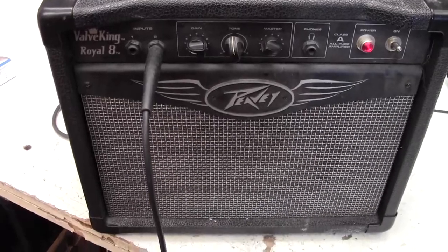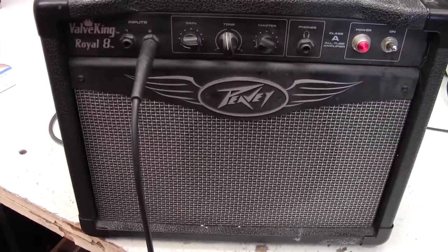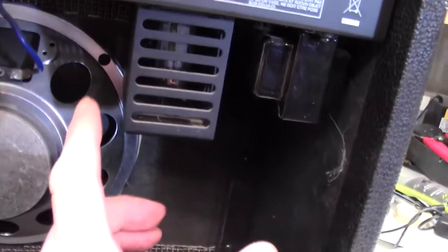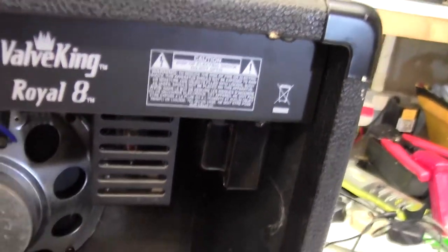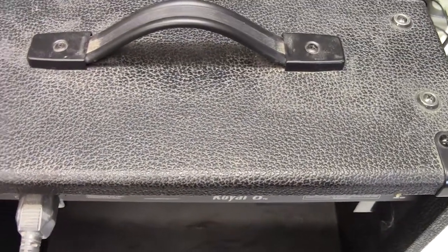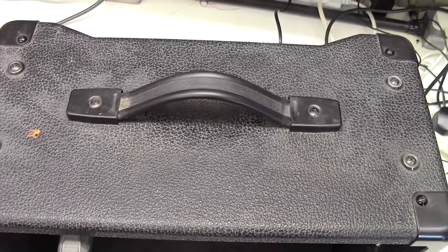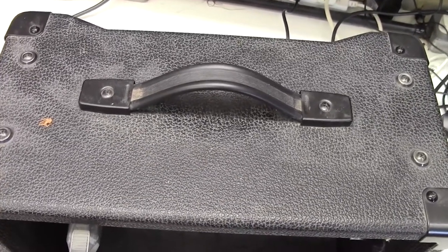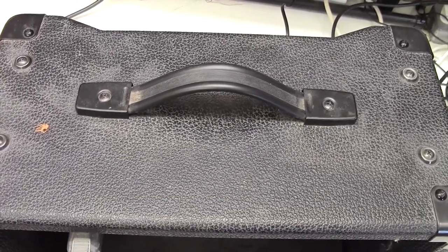We'll eliminate that first. If it's not that, it gets a little bit more complicated. I'll show you a way of checking for that fairly quickly. Around the back of the amp, they've put this cage over the output valves and it's not very easy to get out without taking the chassis out. It's not a major job to drop the chassis on this amp, but with these subtle resonance problems I don't like to disturb too much — sod's law says you get the chassis on the bench and everything's perfectly okay. But I think I'm going to have to do this, so the next thing is to get the chassis out and double check we've still got that problem, then take that cage off and check the valves for acoustic resonance.